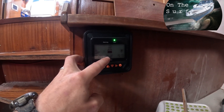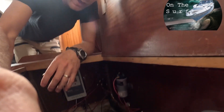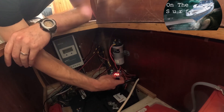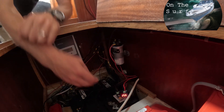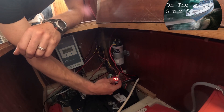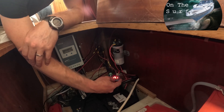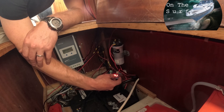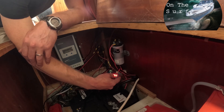The MPPT says it's 26.0 volts, so let's start with calibrating. Long press — now it says 25.9 and it should be 26.1. Let that time out. So let's say the low voltage cutoff should be 27 volts. Now they are at 26 volts — press once and the low voltage is at 27.